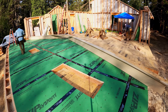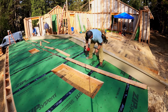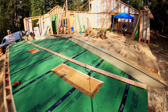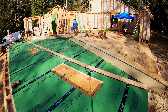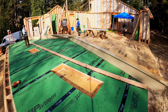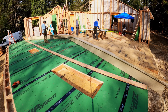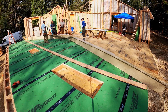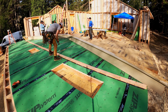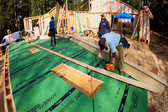Now here's what's a little different on this house. We had some 2.5 inch metal bent. We nail on a bunch of scrap pieces to basically fur out. So the trim that we're putting on is 5/4 by 8 or 5/4 by 10, I don't remember. You can't buy 2x material, but what we like to do is put a layer of wood under the trim so that we can tuck our siding. That will become apparent later. If we use up scrap 2x, you could also use up layers of scrap, you know, ripped sheeting if you had it, whatever. Now we're 2.5 inches from the zip to the outside face of the trim. That gives us 1.5 inches to tuck, and it looks better for the shadow line.